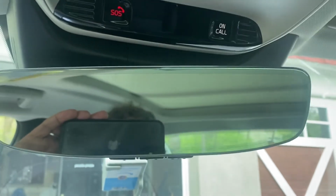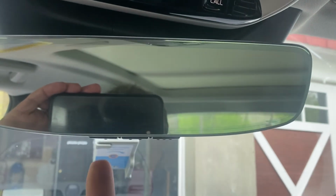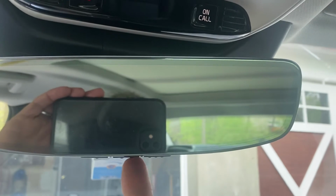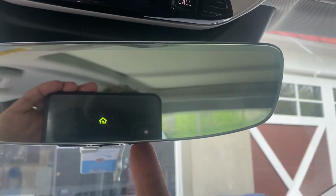So once the indicator light is off, I let go of all three buttons, and I can check to make sure that the car is in D mode by pressing and holding for a second. And if I get the rapidly flashing LED at any of them, then I know that the car is in D mode. So next step is to go to the operator.